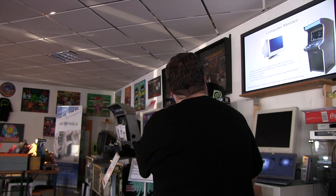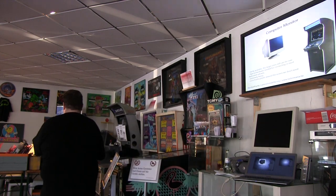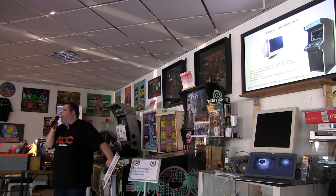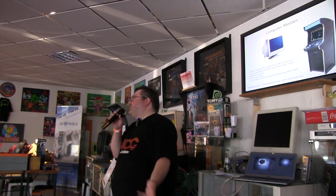And then of course the VGA monitor. Same problem here as with the TV, plus it works at different resolutions. As you have heard, most arcade games run at what's called 15 kilohertz, which is a resolution, while VGA is 31 kilohertz, and they're not directly compatible. So we'll need to come back to that later. Also, if you want to go to 20-21 inch, that's when the LCD screens came in, so you don't really have CRT VGA monitors in that size unless they're really expensive professional screens.